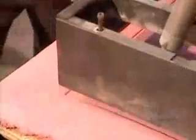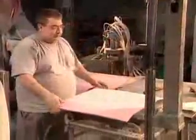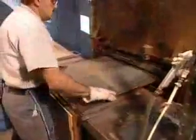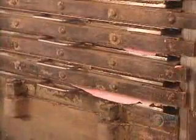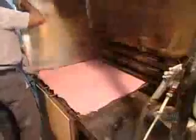They leave it to cool and harden at room temperature for about half a day. When the rubber's ready, they cut out large squares, each weighing between 5 and 8 kilograms, depending on the thickness of eraser the client has ordered. The squares go into a steam-heated press to cure for about 20 minutes at 163 degrees Celsius. The pressure compacts the rubber, while the intense heat hardens it.